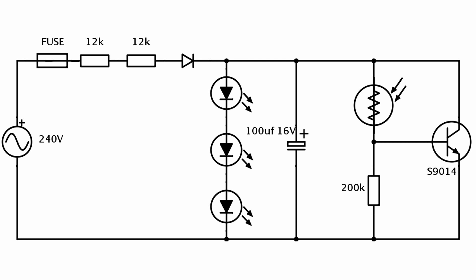Whilst this does actually turn the LEDs on and off, it seems rather wasteful, because in either state — on or off — the current flowing in the circuit is going to be pretty much the same. It's primarily determined by the values of those two large resistors, which in this case are 12K each, or 24K in total. So had they just left out those 3 components — the LDR, the resistor, and the transistor — it would have cut down the cost of manufacture. The result would have been the lights on permanently, but it wouldn't have actually used any more or less power. So quite an odd way of turning things off by effectively shorting out the 3 LEDs in order to turn them off. Normally you would use the transistor to actually turn the LEDs on and off directly, but apparently not in this case.